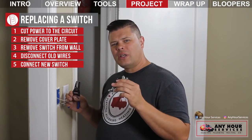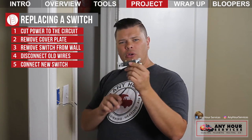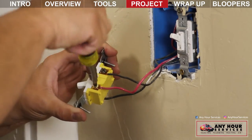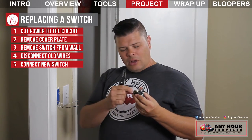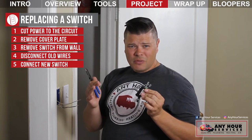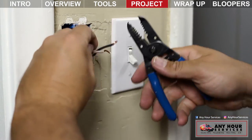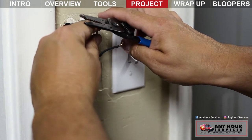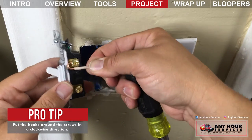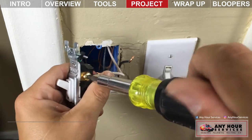When reconnecting the wires to the switch, on the back of a single-pole switch it won't matter which terminal you hook the wires up to, but if you're changing out a three- or four-way switch, it does matter which one you hook it up to. As an apprentice electrician, I was taught to hook the wire over the terminals on the screws, but manufacturers have added holes in the back so you can use those if you want. Once you've stripped the wire, you want to make a hook — on my strippers I have a hole that I use, or you can use pliers if you wish.